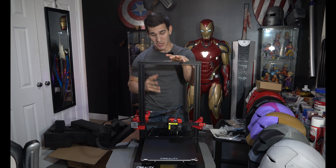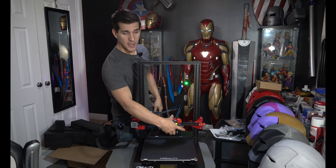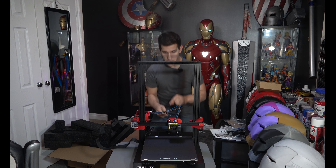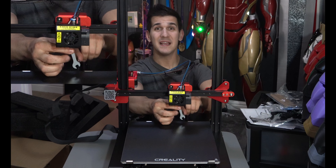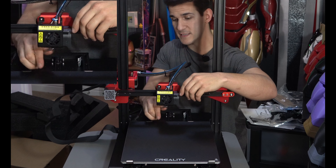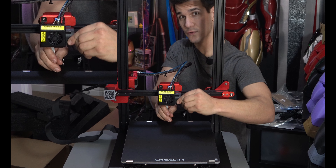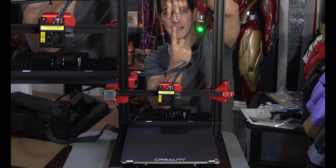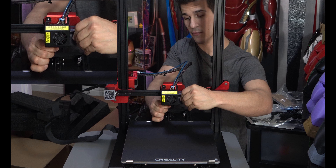A couple of things I want to check for: I want to see if our gantry wobbles forward and back, and it doesn't. You'll see this on the groups and forums all the time — people grab their gantry and the whole thing is wobbly. If yours is wobbly, take your double-ended wrench. On the backside you have three wheels on the bottom wheel, and there is an eccentric nut. The big side of your wrench will fit and you can twist and spin this. As I loosen it, my gantry goes loose. But if I tighten it, it starts to tighten up the gantry — putting tension on the two top wheels against the bottom wheel so it only moves forward and left and right without wobbling.